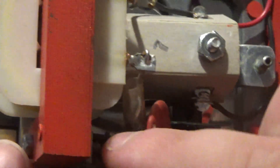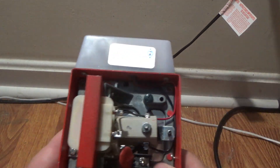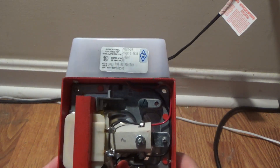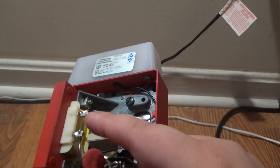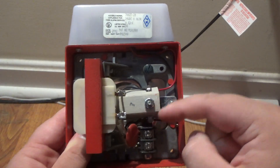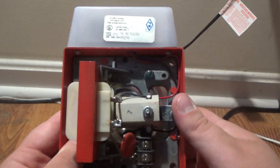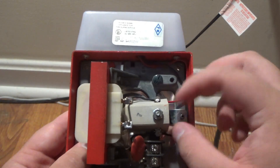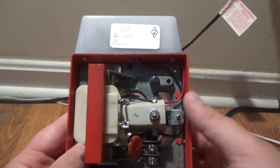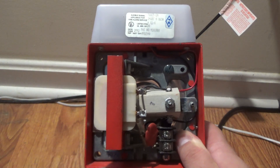Here are the terminals down here. Inside this little plastic tube is your polarization diode, because a lot of older alarms need to be polarized — that's how the NAC supervision works on the panels. As you can see, the strobe is wired in series with the horn. So you have the transformer, the coil, and wires going up to the strobe. The strobe takes power away from the horn and withdraws energy from it, and when the strobe sucks up so much power, that's what causes it to skip a beat. That's basically how all two-wire 7002Ts work.